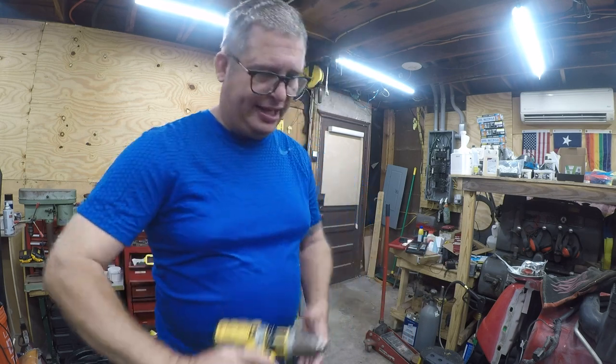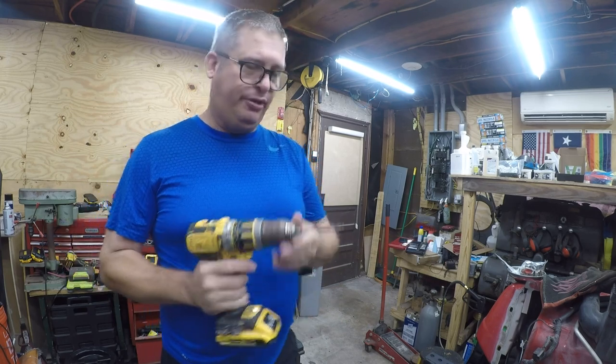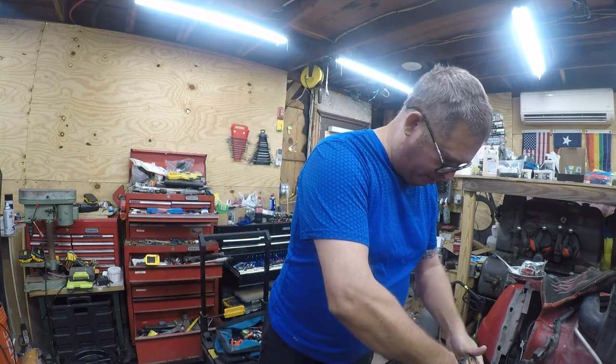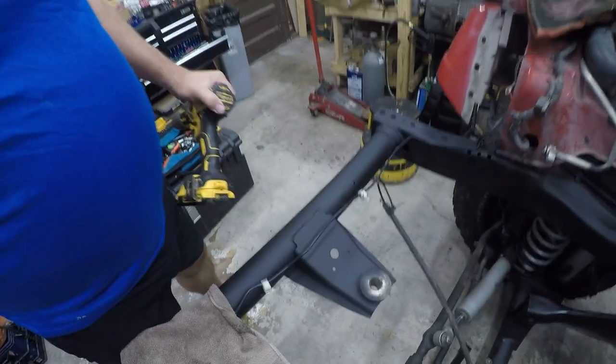Okay, so it calls for 13/64, and the best I can do is 3/16, which is 6/32 or 12/64. So we're 1/64 of an inch off. I don't think it's going to change the price of tea in China. I have a quality Milwaukee drill bit chucked up in my very raggedy DeWalt drill. So we're going to put it in the same spot, and let's just see how this goes.